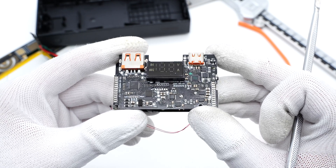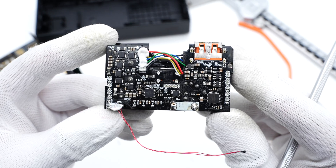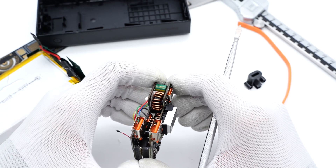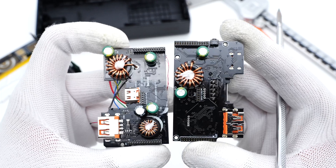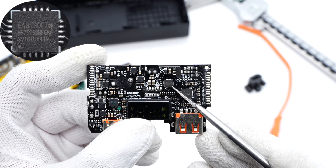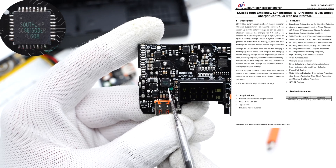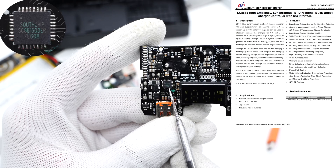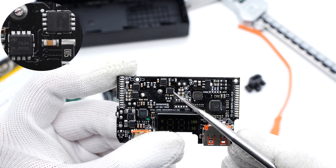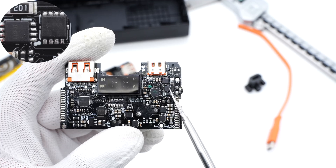Back to the PCBA module. We can see the segment display, USB-A and USB-C connectors, and the protocol chip, MCU, and some MOSFETs on the front. Flipping to the back, it has a synchronous buck-boost circuit and a buck circuit. Slowly separating the two PCBs, we find three inductors and corresponding filter capacitors between them. The MCU is from Sinowealth, which controls different functions and the display, with a clock rate of 20MHz. The protocol chip comes from a USB PD 3.0-supporting chip. The synchronous buck-boost controller is from South Chip, used for the bidirectional buck-boost output of the USB-C port. The synchronous buck-boost MOSFET is from AOS — same package as the battery protection MOSFET. The two VBUS MOSFETs for USB-C are from GoForward Semi, using DFN 3×3 package, connected in series, rated 30V, 10.6mΩ.